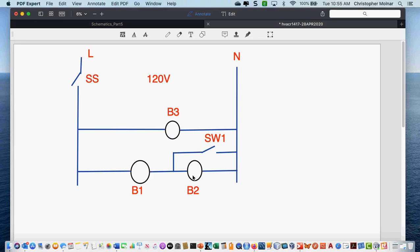What do I have to have on the line voltage side instead of a switch? The relay contact. What do I have to have on the control voltage side? The relay coil. And a heating thermostat — a switch, a thermostat. I didn't specifically put a thermostat in my description, you just said any other components we spoke about. But if you put a thermostat in, I'm not going to take points off for that. It's a switching device — I'm fine with that.